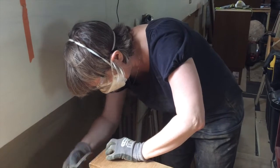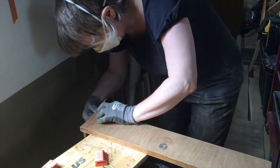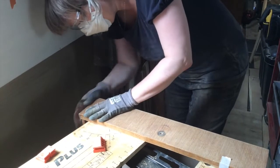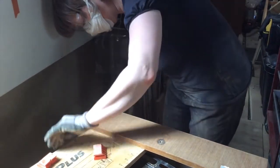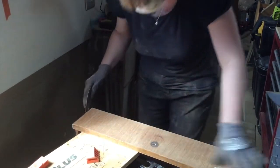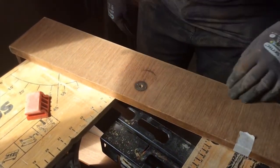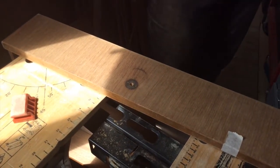There was some damage to it. In some places I had to replace some of the veneer and repair them, and in other places I had to kind of colour in the veneer because it was too fine a crack in the damage. Take back the wood to a level where it was clean again, and then sand it with very, very fine sanding paper, and then oil it.